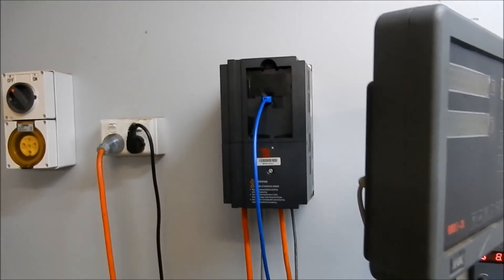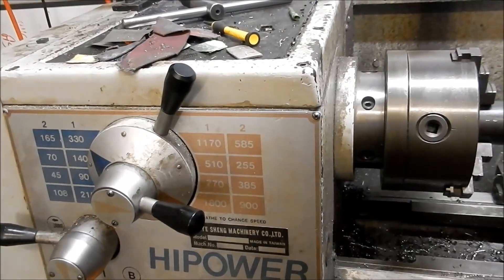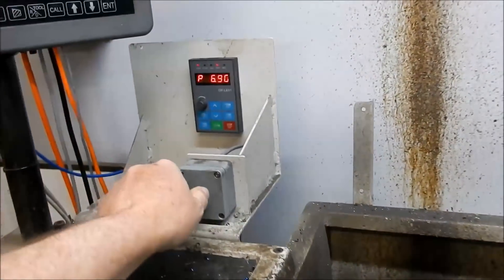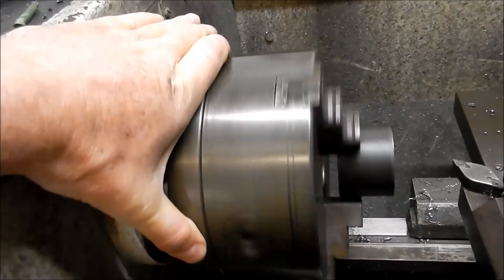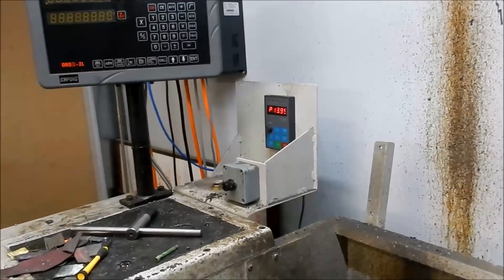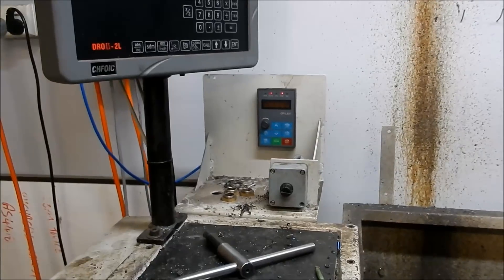The cost on this unit delivered was $265, and it is a sensorless drive. I'll put it into high gear — just a little bit greater than 1-to-1 — and turn that pot right down to around 2 to 3 hertz with a fair bit of pressure on it, and it is not stopping. That's a sensorless drive with constant torque right down from base speed to close to zero — probably down to about 1 hertz you'll maintain constant torque.